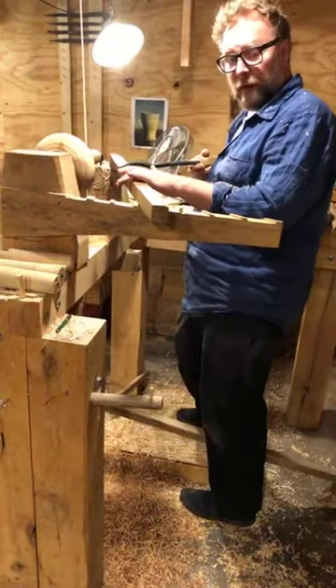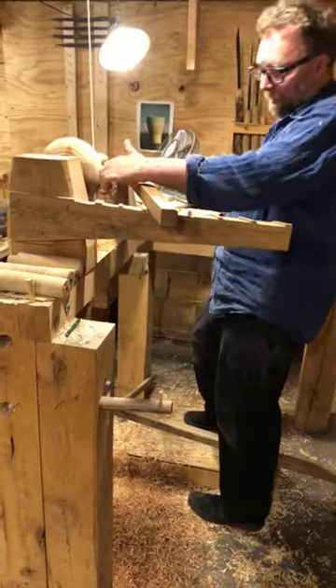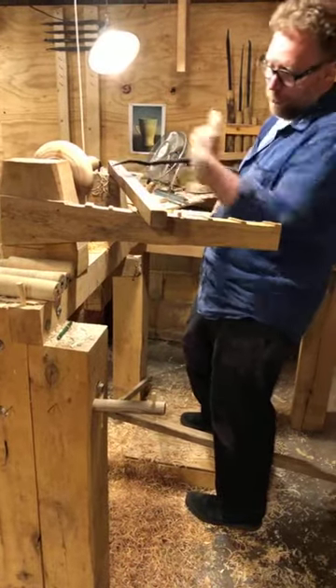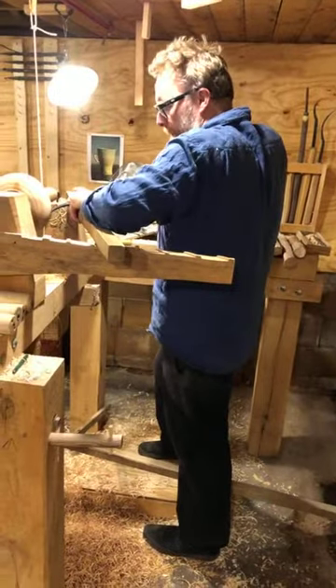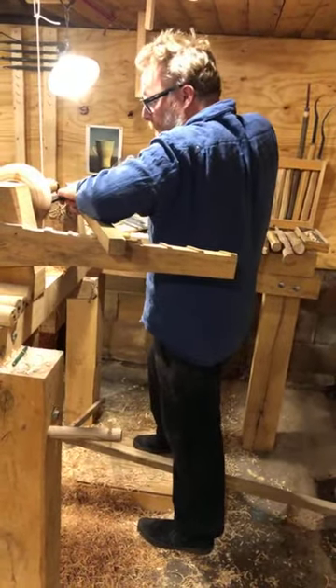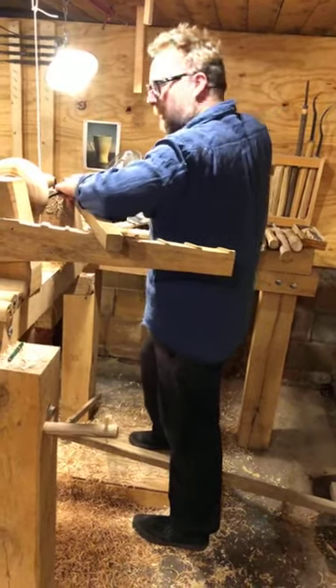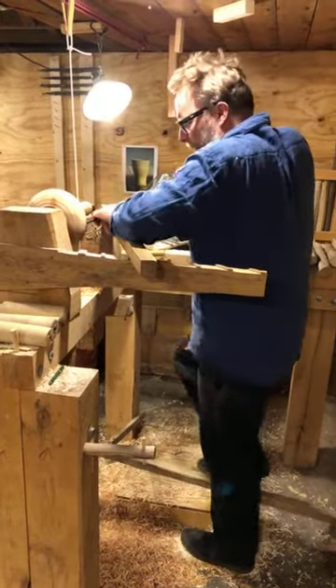My tool rest has a little movement which is interfering, so I'm going to lean on my tool rest to pull it tight against my notch. So I'm pulling back as I pivot — but if I push it, it kind of moves. The nature of the arc pushes the tool back and makes it sloppy. So I'm going to resist against it.